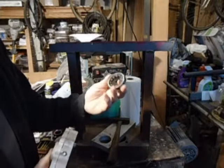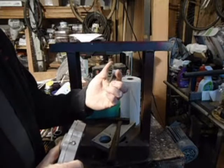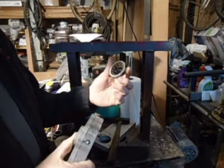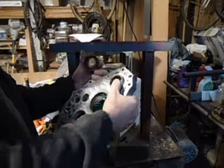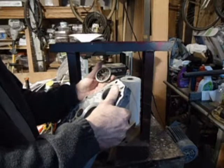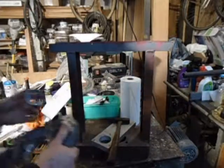That's the upper inner input shaft bearing. This is the one that goes bad when you lose your oil, and oil can't get up to the highest part of the transmission. So when you start up your car and you have a noise coming out of your transmission, you push in the clutch and it goes quiet. That's probably it right there.